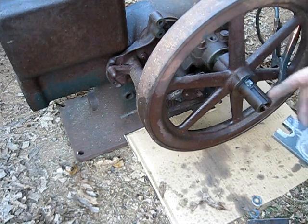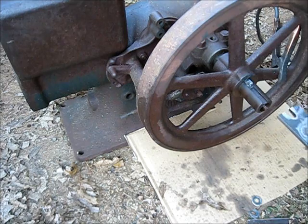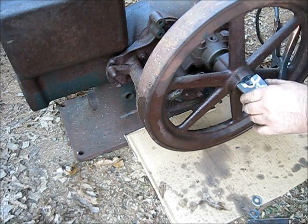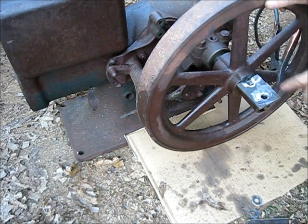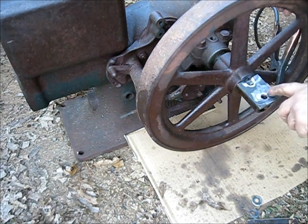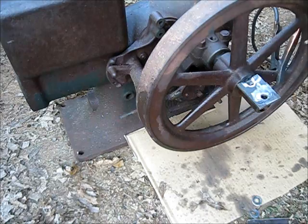A quarter inch by two flat plate, about two and a half inches long. I took the grinder and cut a slot in there — it already had a hole in it, just a scrap piece. It will go right there. The intention is to weld that solid right there, trying to catch that keyway, what's left of it. Then I'll weld a little block right here and use a drift punch to see if I can set it free.